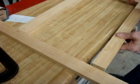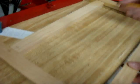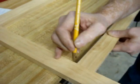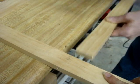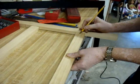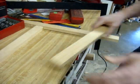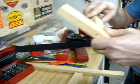We're laying this out now that the holes are drilled, and we're going to mark them. I've marked one, one, two, two. Now we're going to do three and four over here. The reason we're doing that — hold that still, please — is so that we can come right back to the same place, pre-drill a pilot hole in here, and we know it's going to line up when we're finished.